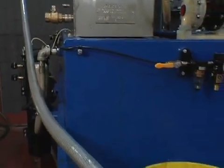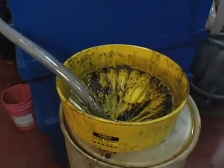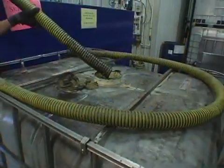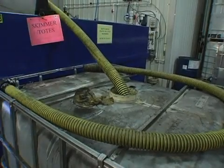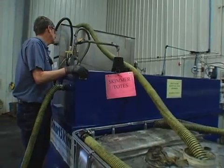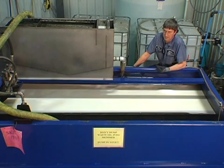Look around this shop — you don't see any smoke in the plant. The oil that creates the smoke is in here and it's coming out right over there, and we're now going to sell it by the drum. They now buy that oil due to the fact that I'm able to remove all the coolants from the oil. So I'm no longer paying out any money to get rid of coolant or tramp oils — we save approximately fifteen thousand dollars a year just in our coolant purchase alone.